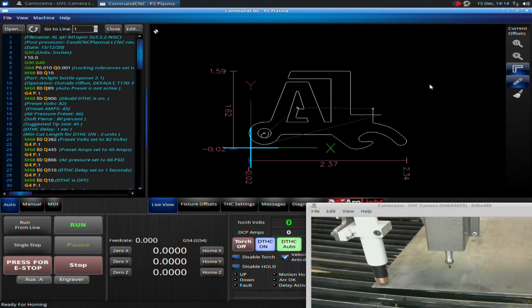People make that mistake all the time, but there's a big difference in the voltage feedback between the two, and they will not cut out properly. Save yourself some hassle — always remember if you're using fine cut tools, or fine cut shield and nozzle, you must be using a fine cut tool in SheetCAM.